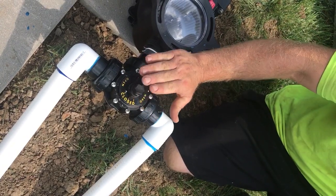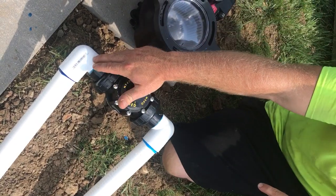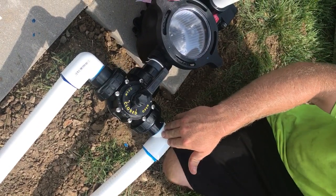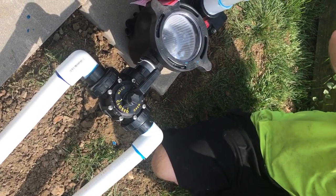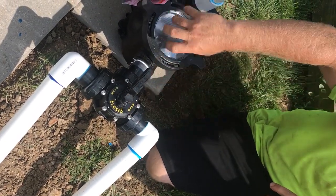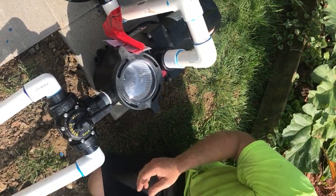Other than vacuuming, 90% of the time normal operation is going to stay just like that. Your pump is going to pull evenly from your skimmer and from your drain — pulling water from the bottom of your pool and the top of your pool. It's going to be split: come through your pump, push through the filter, filter it out through the chlorinator, and then back into your pool — that's called the return.